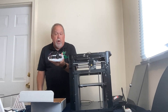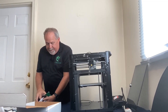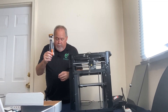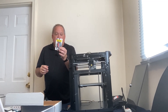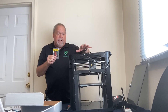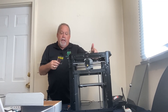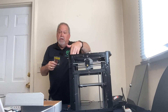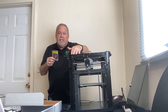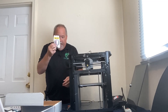We're going to unwrap it and test it before we install it. Also in the box are a utility knife and a switch — your limit switch that goes inside the printer. This is how the 3D Chameleon and the printer communicate. The Chameleon's tool-change G-code commands the extruder to come over and touch the switch; that triggers a sequence of commands sent to our electronics, which then executes the tool change.